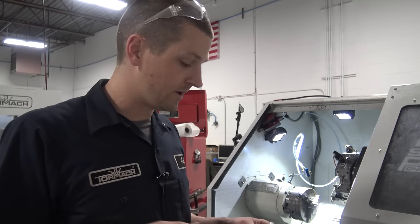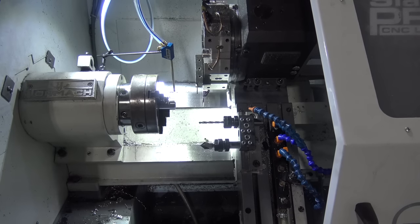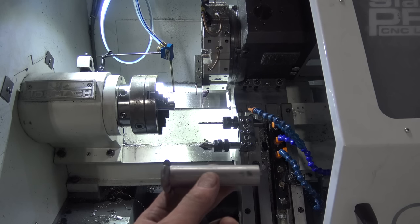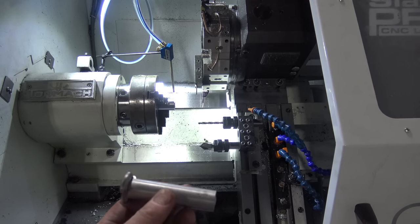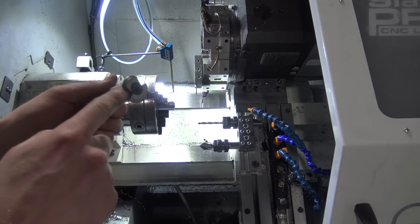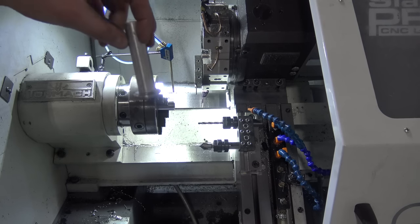But I goofed because I basically had to recut the other side here because I had it backwards. So if we ran it in the lathe, it would be held like this. Actually, it would be upside down. So it would be, well, maybe I really just did screw up. Basically, I originally cut it this side, it needs to be on this side. This won't hurt a thing. So that's going to be our cutting edge when it rotates in our Tormach mill to thread mill the threads.